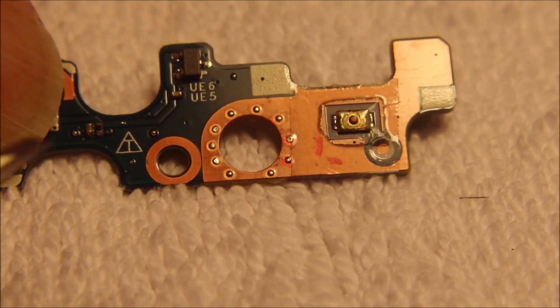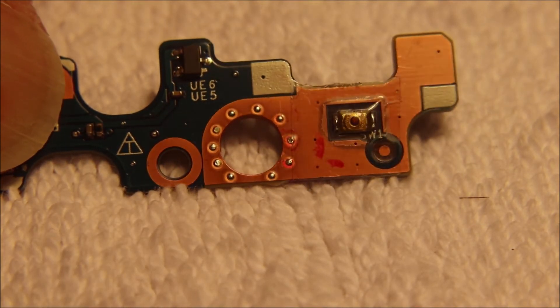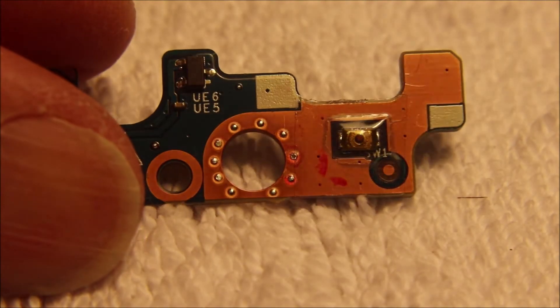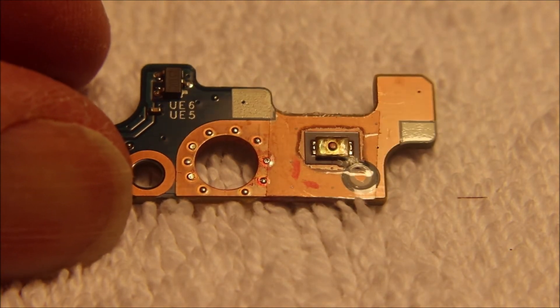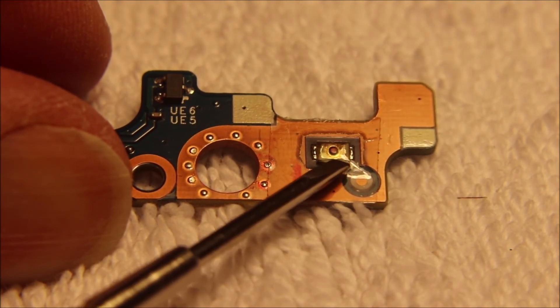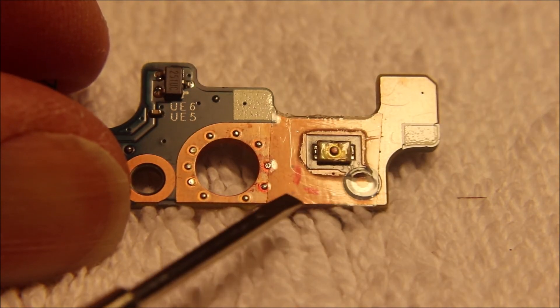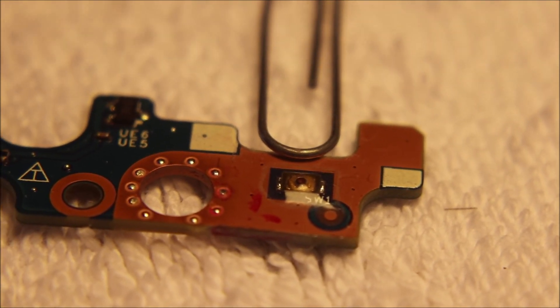I would imagine that this tape is going to wear away after repeated on and off operations, but it worked beautifully for me and it may do so for you. It is critically important to get that black dot centered in the right spot — it has to be at the very center of the dome. You're going to need a good magnifying glass to see the correct position, because this is a very tiny board. The push point itself is less than the width of a paperclip wire.